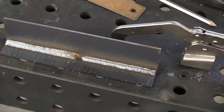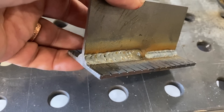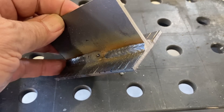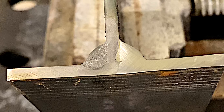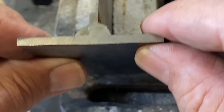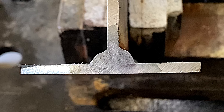I like to test things, so I chopped through each weld, polished it, and put a little acid etch on each one. This is the slow travel speed — that's not a bad penetration profile. Flip it around now and do the faster travel speed. The one on the left is the one I'm really concerned with — not bad, a little bit smaller weld size, but it hit the root.